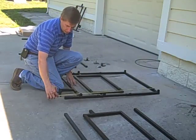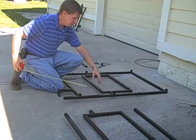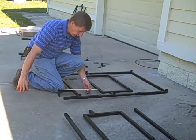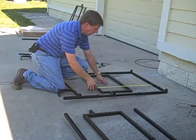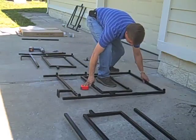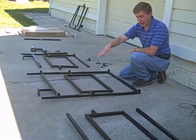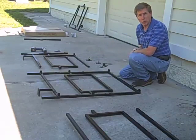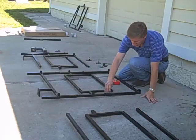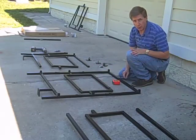So if we need 42 inches, set it to 44. We're going to set the height keeping the center bar aesthetically pleasing and equal. I've got 10 inches here and 11 or 12 inches there, so I need to bring this down just a little bit to the distance I need. When the height is set, take your set screw wrench and tighten the set screws — but don't tighten them too hard yet, as you may want to make an adjustment.